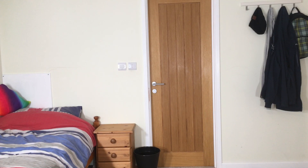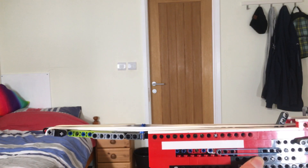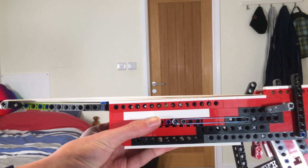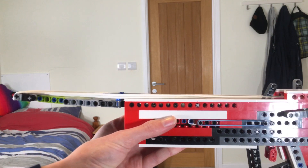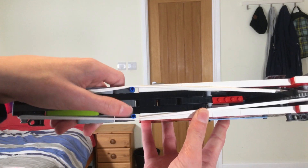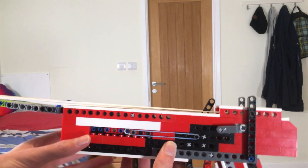I've now finished all the modifications on the gun. As you can see, it has a much longer barrel, so the rubber bands carry more energy onto the bolt pushing it all the way forwards. It's bending a bit but in the final design that won't happen as it'll be a much tougher build — that's also why I've only loaded five rubber bands for now. It also has two blue pins to keep the rubber bands on the outside so they don't contact the bolt, which was making the bolt harder to return. We've kept two rubber bands, one on either side, to keep things even.